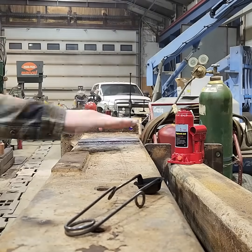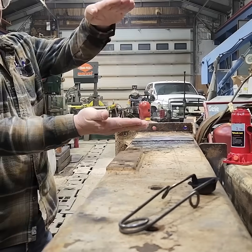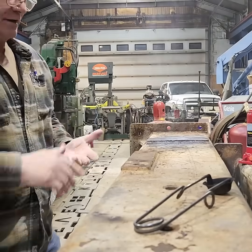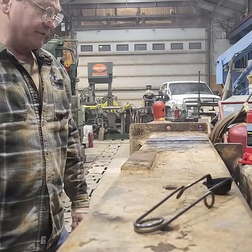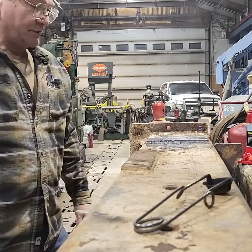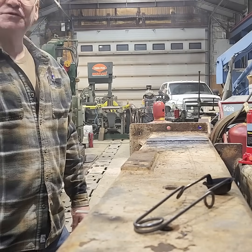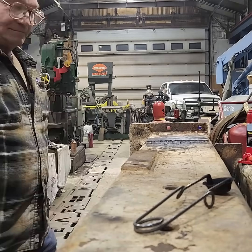It had gotten caved in. There's a pin that goes between these two sides and it has a set distance between them when they tighten it down. With this dip in here, while it's not doing anything other than holding that one pin, it just wouldn't have let the pin shoulders tighten up against the nut. So we pulled it out — we welded the hole up, we're going to drill and ream both sides to fit their part. And it will then be, once again, good as used, and most importantly, back in service.